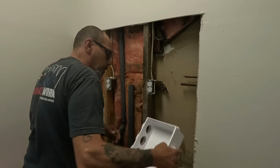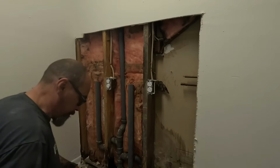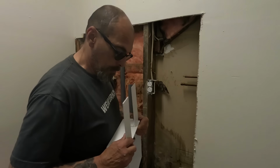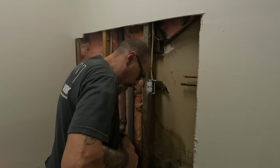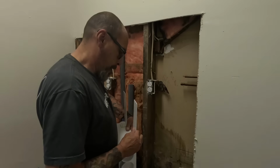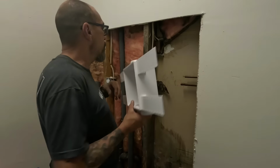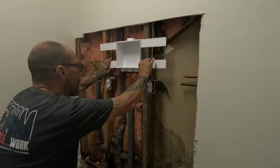This is pretty cool. Put the little finger on it. Good thing. Just put them on there for how thick the drywall is, basically. About half inch. You can set them for like 5/8 if need be. You know, the distance, right, half inch. Three holes on one side, one wants to be on the other side. So, I can adjust that right where I need it to be.